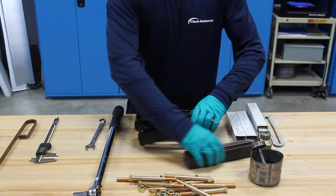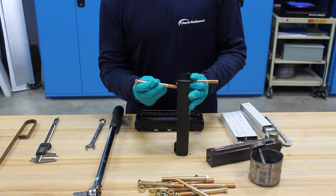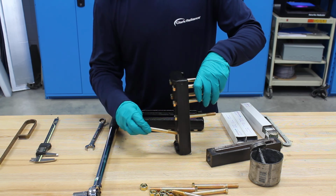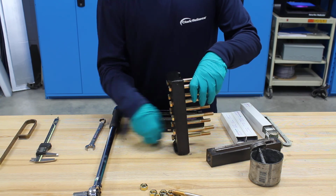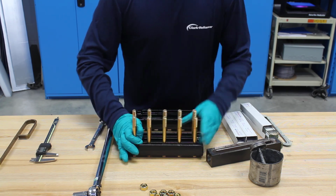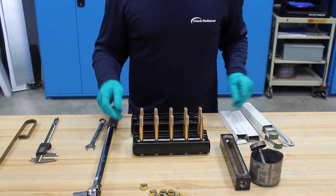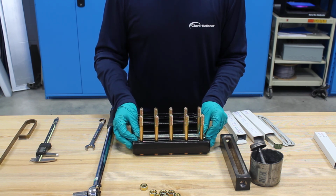So with a transparent gauge, I'll start by putting my bolts in the cover, like you see here. Get that set up on my table so that I have all the bolts sticking up like that. Now at this point, I'll put in my new cushion gasket on the lower cover, and then my new piece of glass. Try and get that centrally located in there.